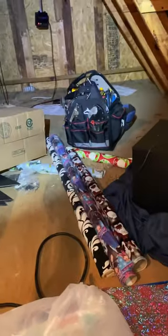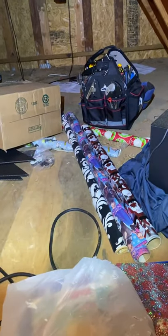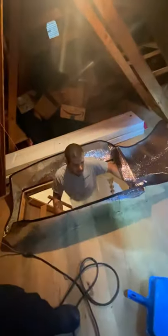We removed all this stuff. My boy Don is making a guest appearance — I'm gonna sweep this up, get this drain pan set, bring the air handler. He's gonna start with the plenums and start getting these holes cut out. We got our platform swept up — I'm gonna put our drain pan, get some space to get behind it, tape and all the other good stuff. Plenums have to fit between the truss and the duct work.